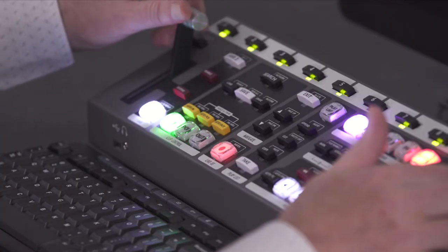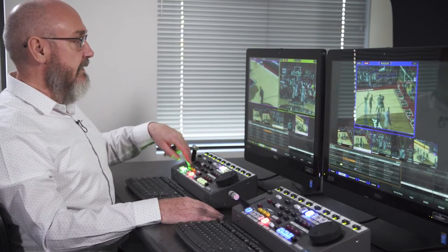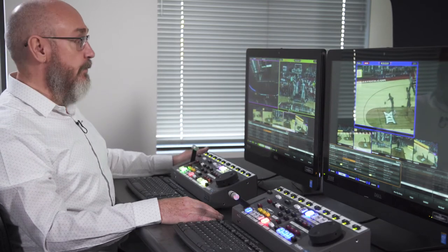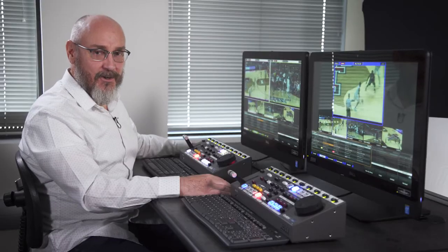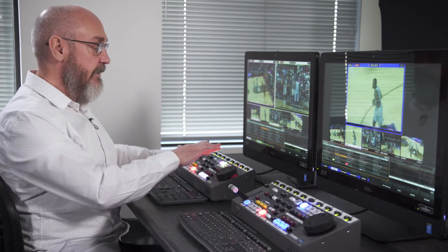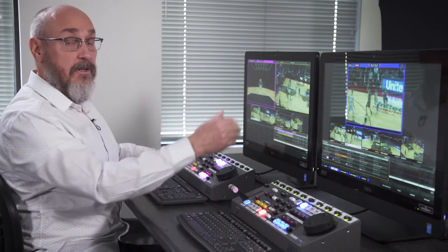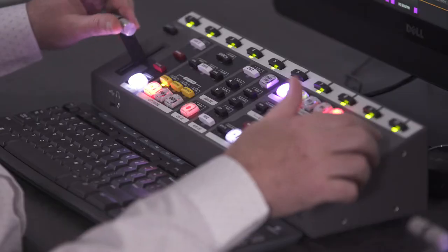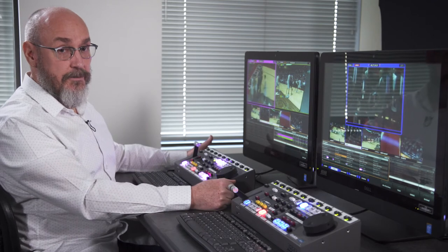Once we have a playlist defined, we can air the playlist out of one channel while performing another task on the second channel. I'll queue up the playlist into the air channel and begin playback with the T-bar. Meanwhile, I can select my other channel and perform a live replay operation. Once I mark an end point, I can seek to it and roll a live replay, which can be slowed down using the T-bar as well. Meanwhile, the playlist is still airing in the primary channel. If we wish to use both program channels to air a playlist, we can gang the channels together — which is what the white frame signifies on the two program outputs. I can load a playlist and operate it in preview-program mode, rolling with the T-bar and using the take button to transition to the next item in the playlist.